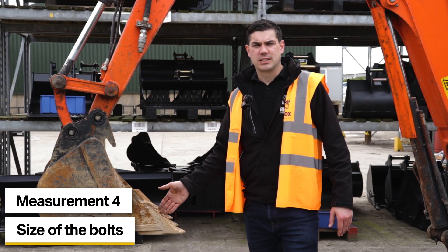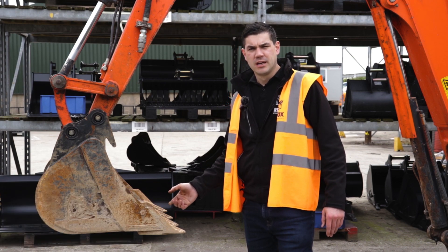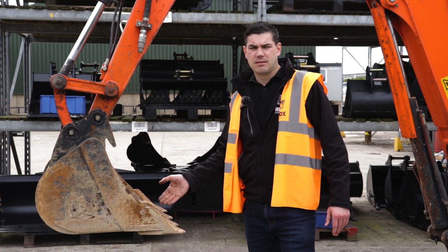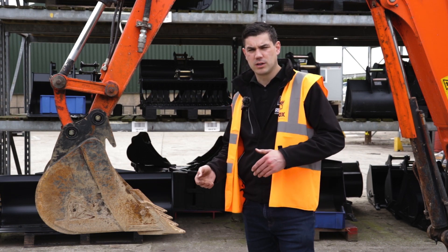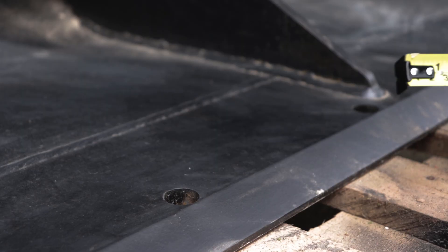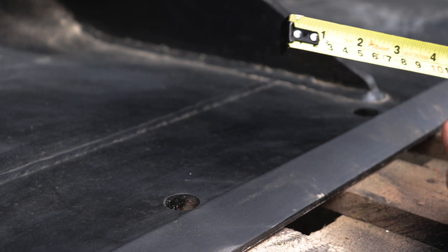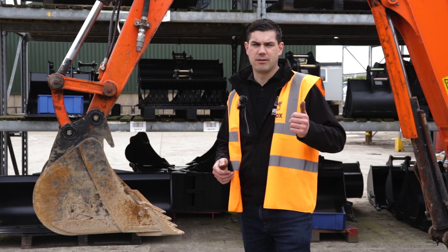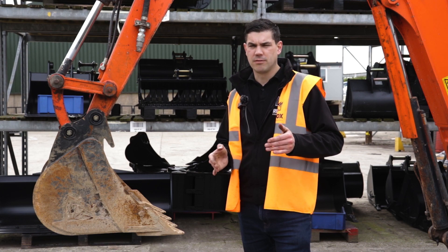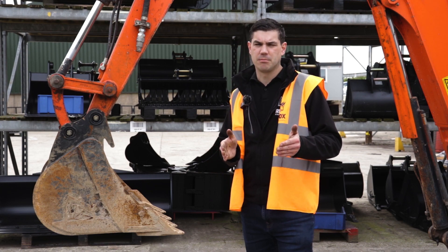For the next part you'll need to measure the diameter of the bolt hole to enable us to get the correct blade for your machine. That's obviously done with the tooth or blade removed, so you'll have to remove that first. If you want to see a video on how to do that, check out the video up here. Once you've done that, you can measure across the bolt hole to determine the size of the bolt. Just a word of caution — generally bolt holes are a fraction oversize to allow clearance for the bolt, so if it's a 14mm bolt for example, the hole will probably be up to about 15 millimetres diameter.